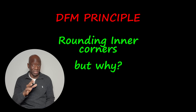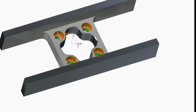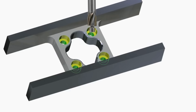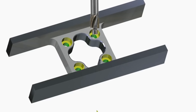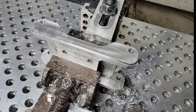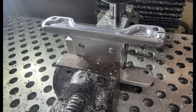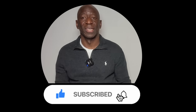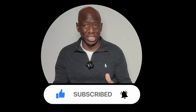Why are the radii important to the inner corners? Why not just leave sharp turns? Well, this is another DFM principle — go down to the comments and let me know. I then add the counter bores, which will house the machine screw heads, using a standard counter bore followed by the chamfer tool. If you're liking this type of detail, smash that like button, subscribe, and mention it in the comments so YouTube will share the videos even more.